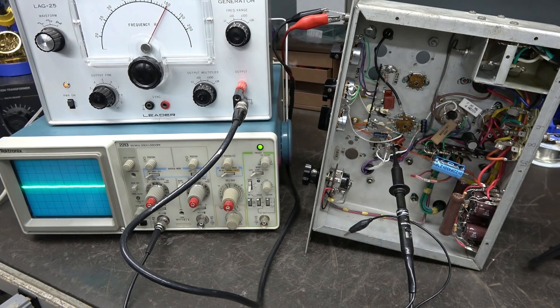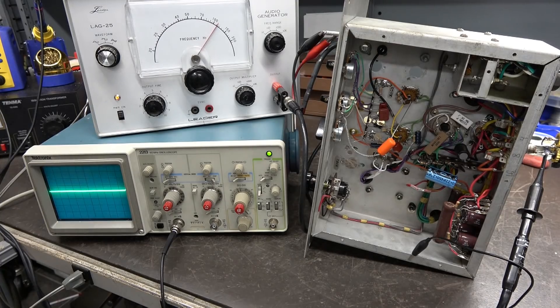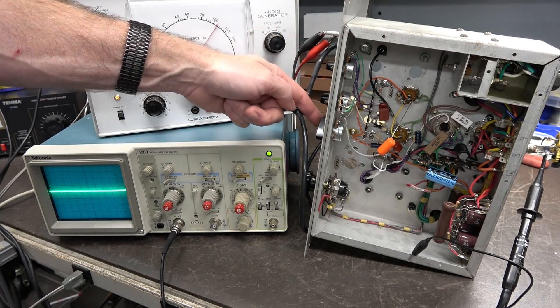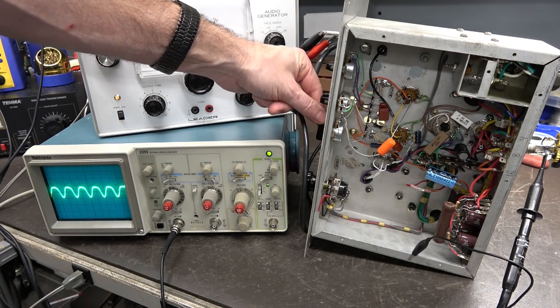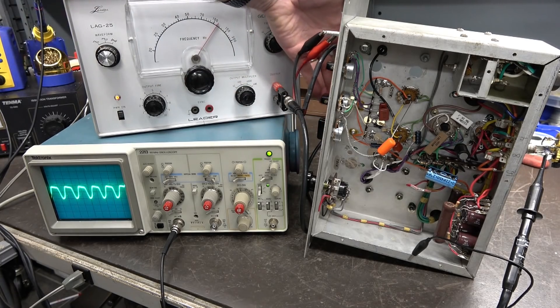Let's make the improvements and see what we get. There is the new tube socket for the single triode post-tone amplification — I'll get that wired up and test it. I've temporarily installed the new circuit and played with the plate resistor to get the right amount of gain. With the master all the way up and tone controls straight up, we can now go beyond the point of breakup to where we get some feedback action, which I can bring back with the master. That all looks good.